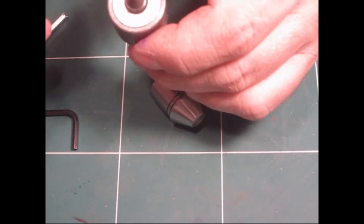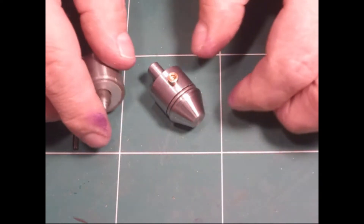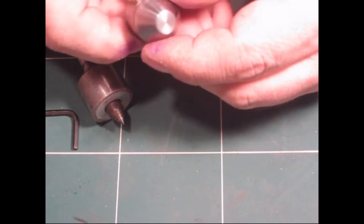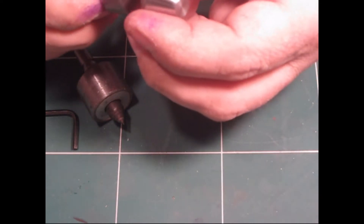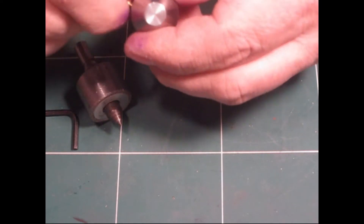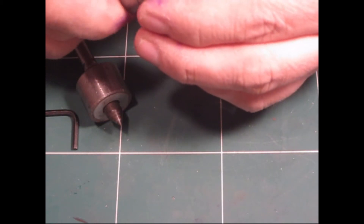You could, but you'd have to make some sort of jig to hold the end somehow. So I've decided to make a larger live center, and I also wanted it to function as a dead center. It has a drilled-in notch or groove which I can lock using a screw so it won't turn.